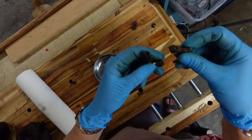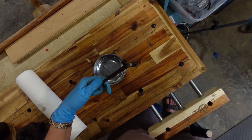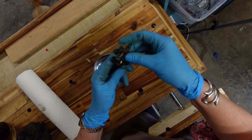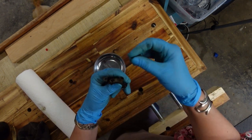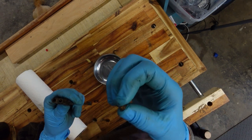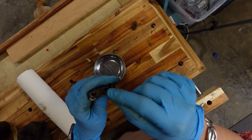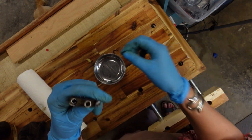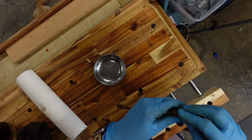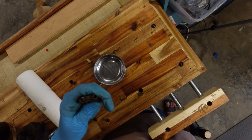It took a third hand because I had to hold the bottom of this over to one side with one hand, with another hand a flashlight, with another hand a screwdriver, but you know. Got it off. This is what the top looks like. The oil wick, it's old. It was saturated with my penetrating oil, so I'm just going to put a new one in here when I'm putting it back together again. But I think I am just about ready to do my final run through on taking it apart.